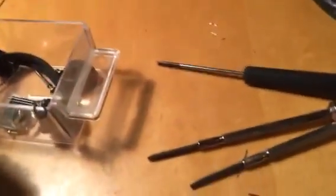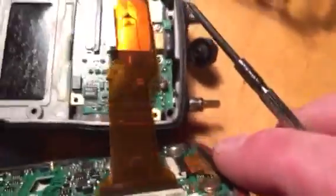These retaining locks just need unscrewing — they've got keys in them, I just used pliers. Both unscrewed easy enough. Once you've done that, very gently prise the radio apart. There is a ribbon cable inside, and also a seal, so you do need to be semi-careful. I've taken this one apart already to speed things up — you need to separate the two halves.